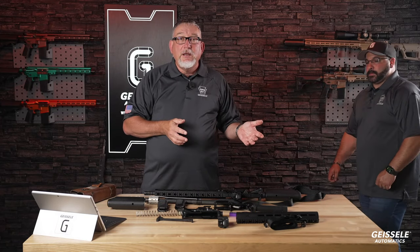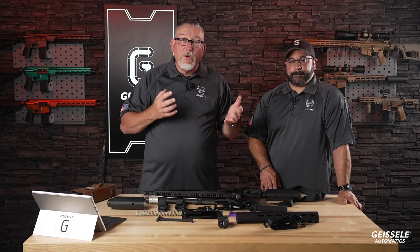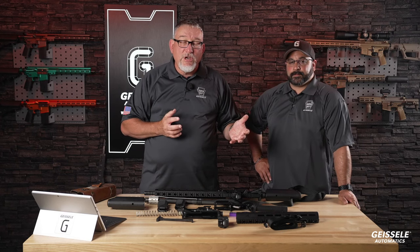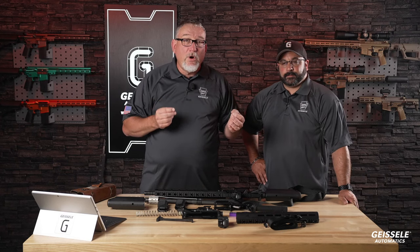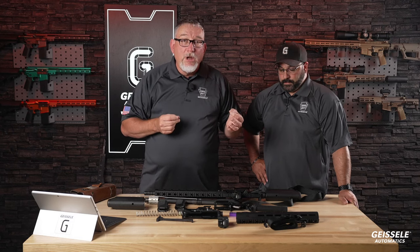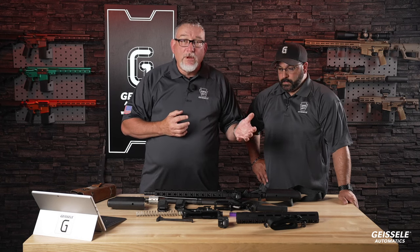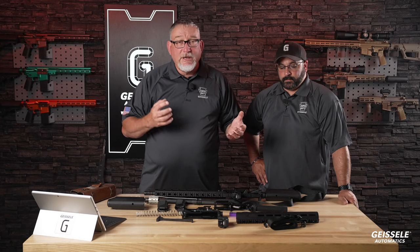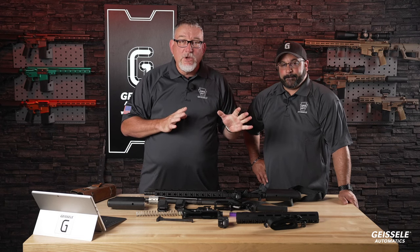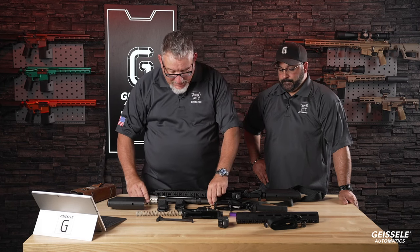The reason they did it is because as the war progressed, it was very difficult to machine. The 8620, even though by today's standards it's easy to machine, but back then they didn't have much in the way of carbide tools, and they had continual issues in the tool room with keeping cutters sharp, and by adding a small amount of sulfur they increased the machinability of the steel. So like I said, it's a blessing and a curse. With 4150 resulfurized, I didn't want to use it. I wanted to use chrome moly vanadium. It's an excellent steel.